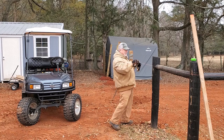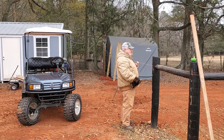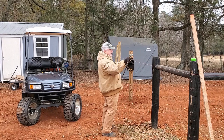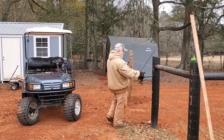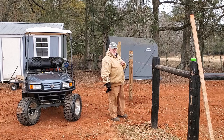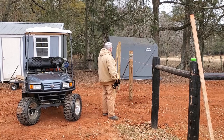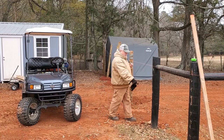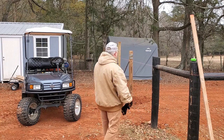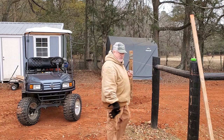And I've seen some fences where people put them on and they're literally like this way, that way, this way, and to me, it doesn't look good. I like a rolling fence that looks like it rolls with the land. So I put the top rail on first, line it up by eye, make sure it's nice and visually nice and rolling with the land, and then I have a spacer board and I work my way down. Some people may not do that, but I would rather the fence look nice as well as being functional. All right, enough chit chat, let's keep going.